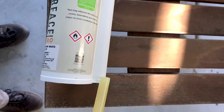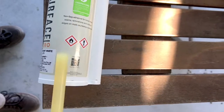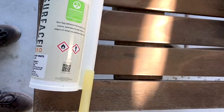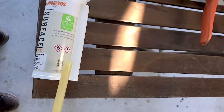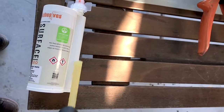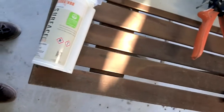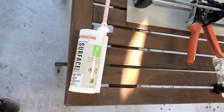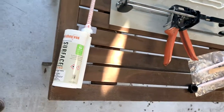So if there's a difference in 4 millimeters in height on the resin side, you can multiply that volume by 10 compared to the hardener side. So we've dispensed quite a bit more hardener compared to resin in this case. And that's due to the pressure that we've created on the gun, which has warped the cartridge and the gun and caused an uneven plunger height.